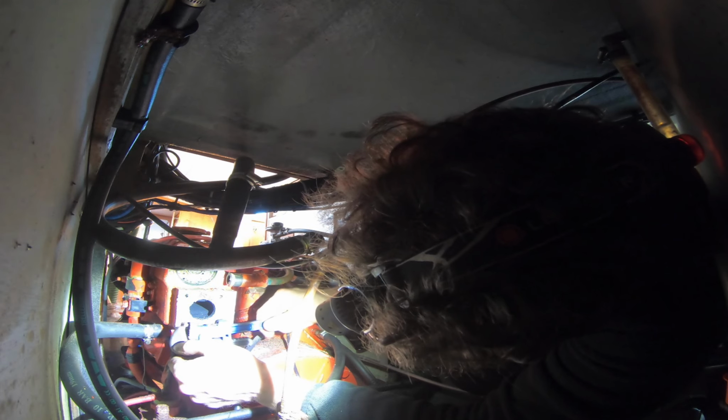It's actually working. I was really dreading having to drill this all out. As I say, trying to do it by hand is just not going to happen, and taking the whole manifold off would have been the next stage. The problem with that idea is you've got another set of studs to contend with, so you could just be moving from one problem to another.